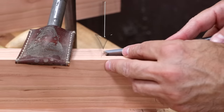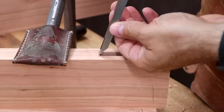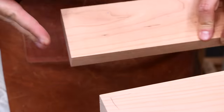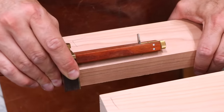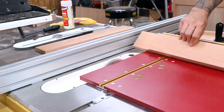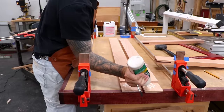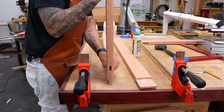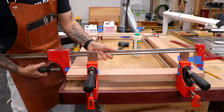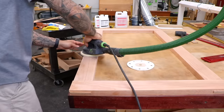As you can see, I did the rest of my joints using the bandsaw method, which requires chisel cleanup after the fact. The male side of the joint is cut as one large tenon, so be sure to scribe the shoulder line beforehand and you'll get a nice clean cut. After finessing and fitting, the frame can be glued together. We want pressure in both directions to close up the shoulders, and we also want to clamp each corner to bring the bridle joints together.